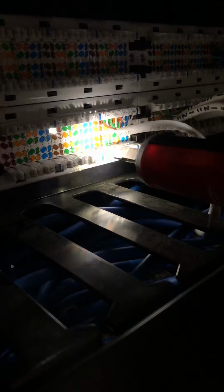And here, all your cables are down, so the excess cable would be up here. So you wouldn't want to cut it like this with that point facing downward, because all you're going to do is nothing. Basically, you're going to cut the bottom part, and it's not going to make any connection whatsoever. So you need to have it up and be able to punch all the excess wires and be able to take them off. I'll show that later.